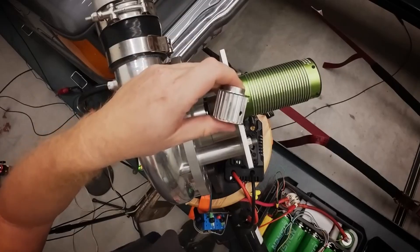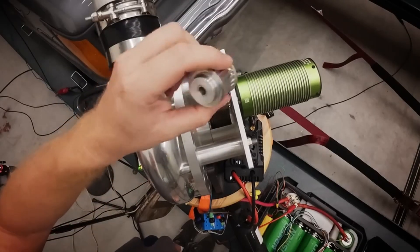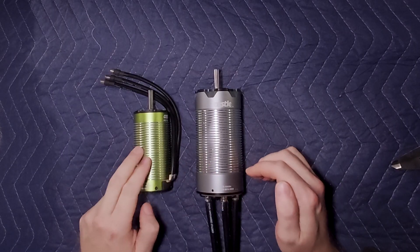So it's a trade-off, and that is why this is ideal for the P2 setup but not ideal for the sledgehammer, which is a direct-drive unit. With the P2 setup we have the magic of the pulleys — I expected maybe a 10% improvement changing pulley ratios, but we practically doubled our power output going to a larger motor pulley. That's one of the beauties of the P2 setup over the sledgehammer.